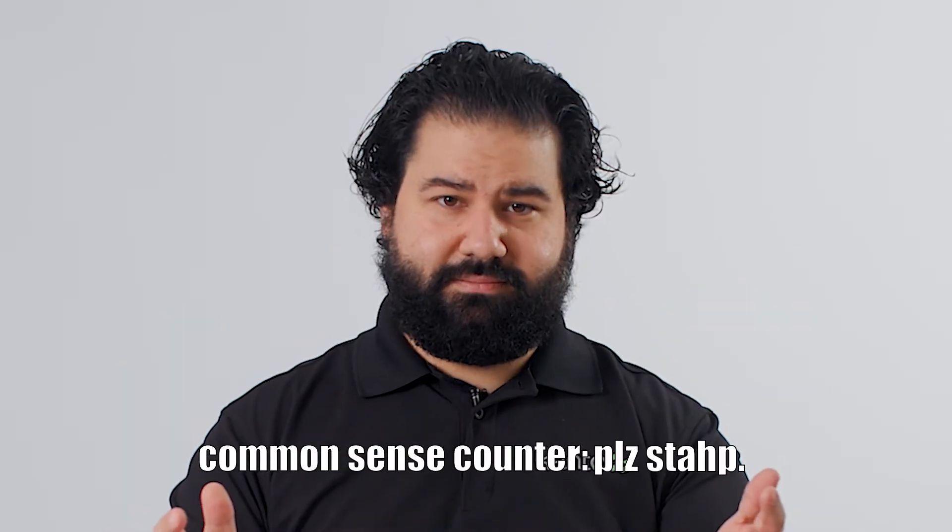What is an appropriate level? You'll know when your speaker is saturated and can't take any more power, because it'll sound distorted or unpleasant, maybe even fatiguing to listen to. If you feel like you're hitting that point, just back off the volume a little — that's as high as you should go. Feel free to overbuy an amp if you're responsible, match it exactly watt for watt, or even go a bit below the max power rating. A 50-watt amp with a U-Passive 4-inch that can handle 70 watts? No problem. Just don't use an amp that's severely underpowered — if you buy an amp that only puts out 20 watts, you may need to run it at max to get appropriate volume levels. At that point the amp has no headroom, so loud transients like snare hits will sound lifeless, the amp may distort, and in the worst case it may even damage the speakers or the amp.